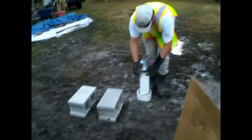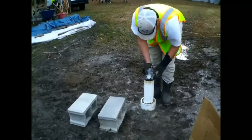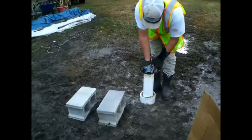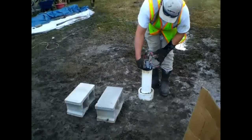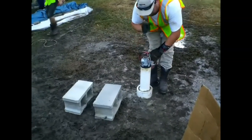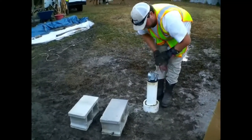This is an ABS well seal, not steel. These plastic ones don't rust like the steel ones do, so they tend to last longer. We use schedule 80 drop pipe — it's threaded drop pipe. Because of what we're doing by adding in a hand pump, we wanted this to all be threaded. It's also more sturdy.